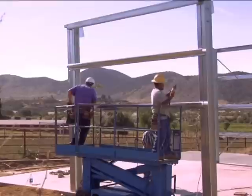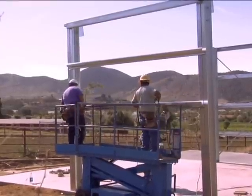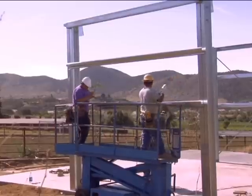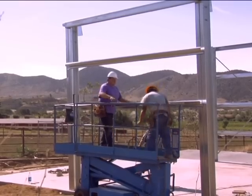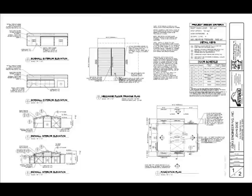When installing screws, install initial screws as close to the inside edge of the column as possible so that you will not have to remove these screws when installing later girts. However, you must remember to install all screws as required by engineering drawings after installing later girts.